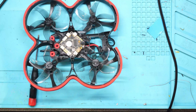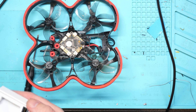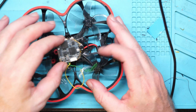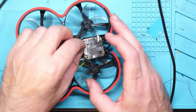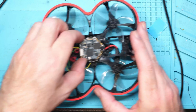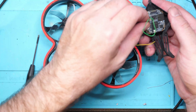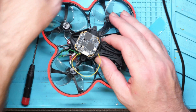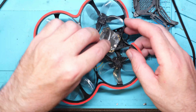We're also going to have to install a receiver, because there is no receiver on this one as standard — it was originally using the DJI system. The board going in is the HD Zero Whoop board. It's not going to fit into that slot there, but it will stack on top of the flight controller from the looks of it. However, looking at the sizing, we can remove the corners off this board, which would allow us to get it in a bit further. It's going to be tight — I do wonder if it will pop in there with the corners off.